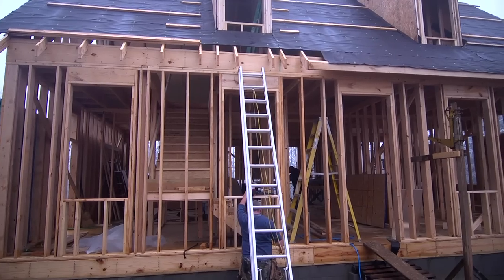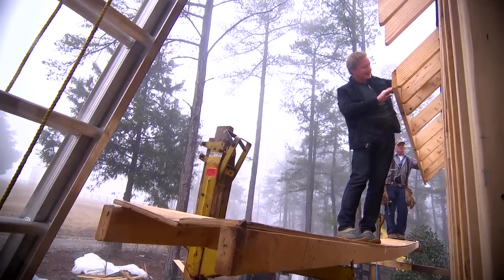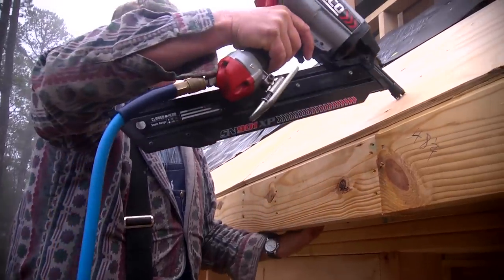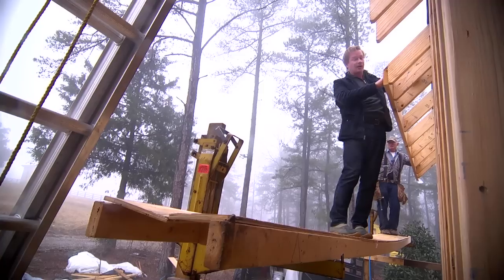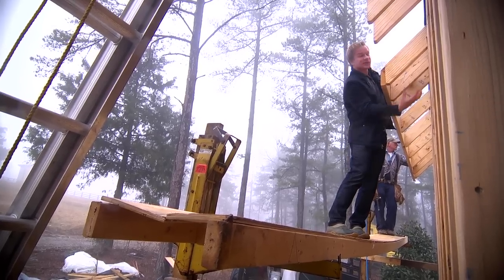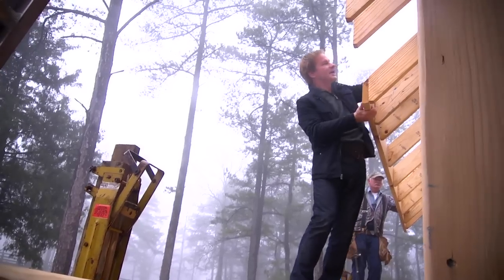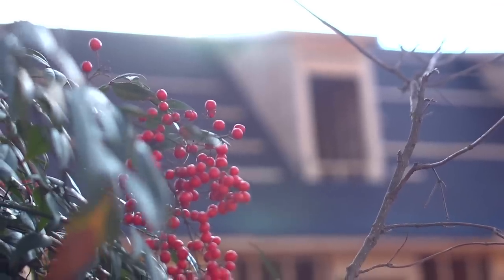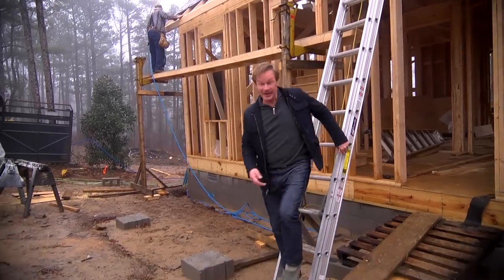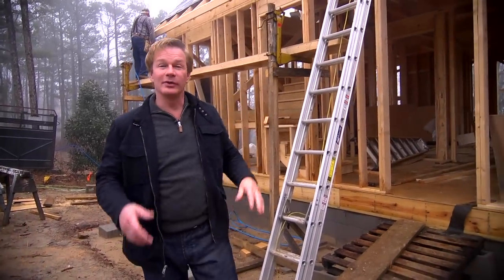I like that — it just shows the craftsmanship of the house. For the roof decking up here, about 18 inches, we're going to use that outdoor grade plywood, which is not a particle board type product. It'll be able to take paint — we'll be able to paint it from the underside. Then what Tony will do is take this waterproof felt and bring it down to cover this off, and then we'll be ready for the roof. It's a soggy, wet day, but he's about to wrap up the roof and we'll be in the dry.